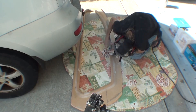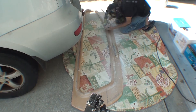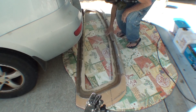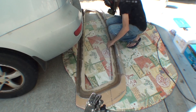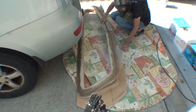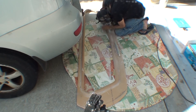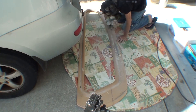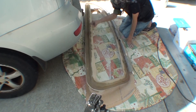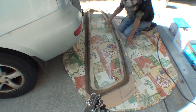You can really smooth it out pretty well through the wax paper. I tried not to get any resin behind these two tubes because that frame has to lay flat there or the hinge won't line up and can't get assembled with the hinge pin. That's what happened here — so I checked it, ground some more, and eventually got the part flat enough that the frame will lay flat on it. I can once again get the hinge assembled, and with a working hinge, I guess that's just going to be it for this time.